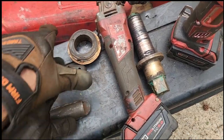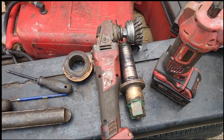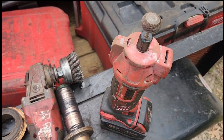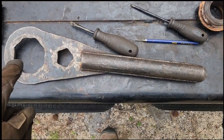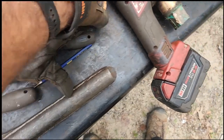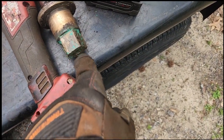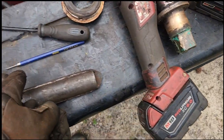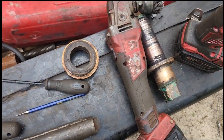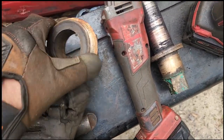We've got the operating nut and the hold-down nut taken off that standard hydrant. There are a few tools we use to clean these up and polish them: one is a grinder with a wire brush wheel, and the other is a router with a flapper wheel — be careful with that flapper wheel because it'll remove metal really fast. There's also the Mueller hold-down nut tool to get that hold-down nut off. We use a screwdriver to get the access screws off and to poke a hole through where the grease has solidified underneath the screw.